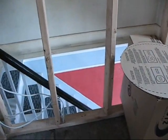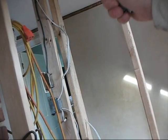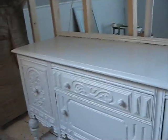That way I can come across here with my water pipes, hot and cold, well the hot anyway, and it's going to be the hot water pipe from the hot water heater, so that the on-demand heater will heat the water until the water gets up here. It'll be an inline setup, so that when you turn the shower on or when you turn the sink on over here, you won't have to wait for hot water. It'll be hot right away, and you won't be wasting all that hot water that's in the line.